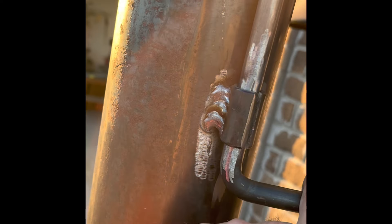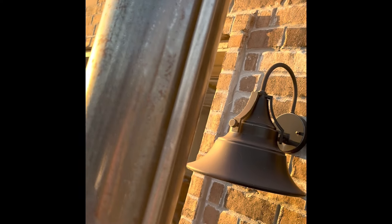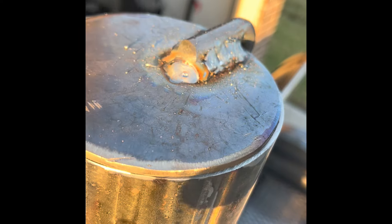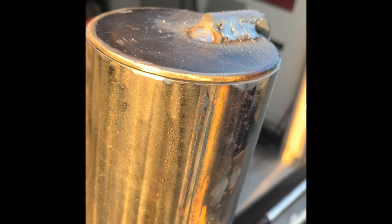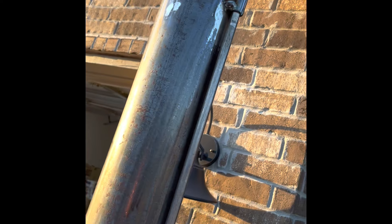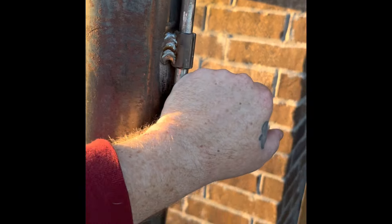I tried to go back and grind that a little bit, and I can rotate it up and down some. I tried to clean up the shaft so it would rotate smoothly, and I got it where it moves. I kind of like it because this part hits this part of the tube so that when I go to close it, it doesn't go any further — it's all closed up, but it's a nice stopping point. So open, close. I tried to seal that gap; I don't think it's necessarily important. It sure stops the flow of air. My purchased barbecues never had a tremendously wonderful seal up there. The idea is to just stop the flow of air either when you're done or to minimize it while you're cooking. So it's working good, it looks pretty cool.